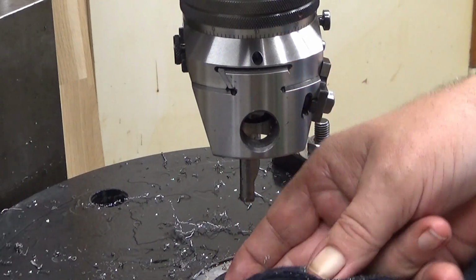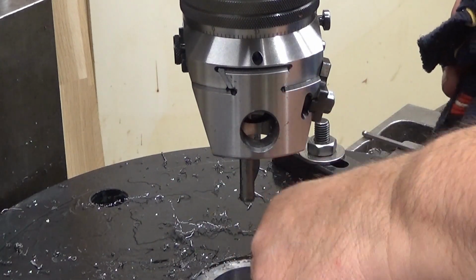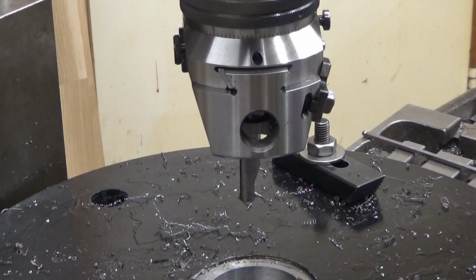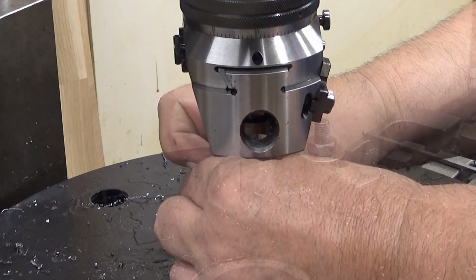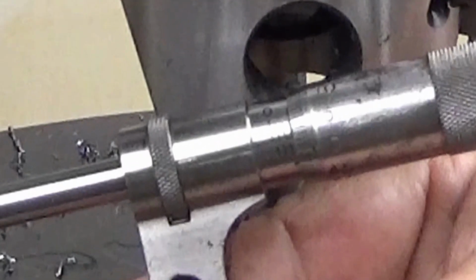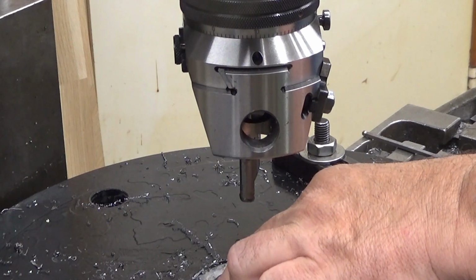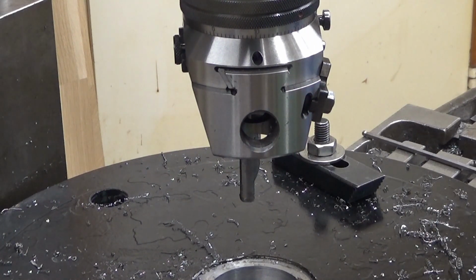Now the surface finish is really, really good. Well, cutting oil is definitely needed with this. Oh, yeah, this is very nice. It might also be that the material was work hardened a little bit, because it had been rubbing around there. So it probably is 53.02. Well, that's entirely okay. So now it's 0.02 millimeter oversized, and if they make their shaft 53 millimeters, it will go there, and there won't be a lot of play.